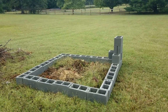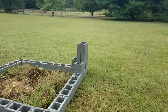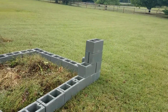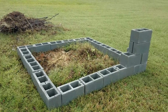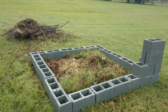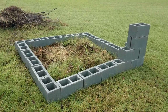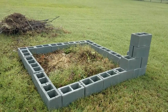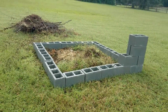I don't like that. I'm going to try to build a fire pit. We're going to call it the Gray Colson Project Fire Pit, and I'm going to have to do it in segments. All I did today was go buy some block, really just enough to get started. You're going to measure it out and make sure it's square. Then I'm going to dig a sort of trench, and you can tell if that's not level right there. And see if I can level this out.